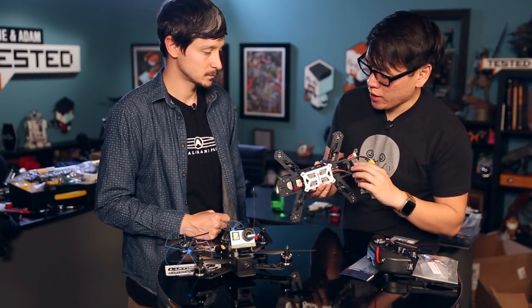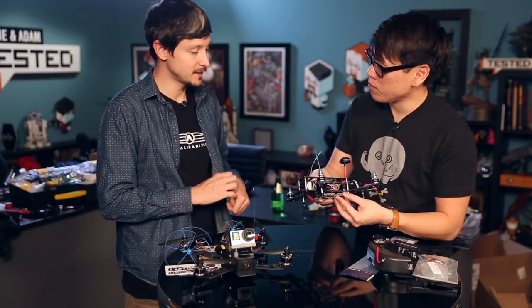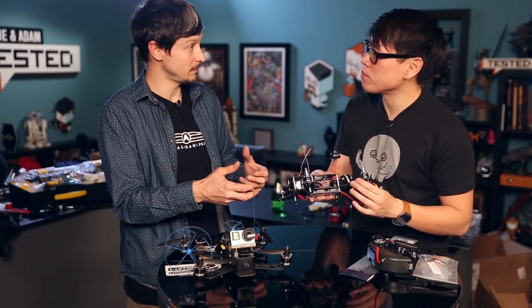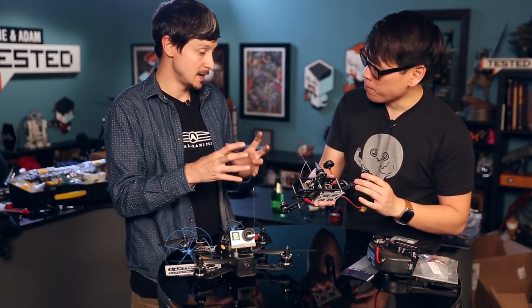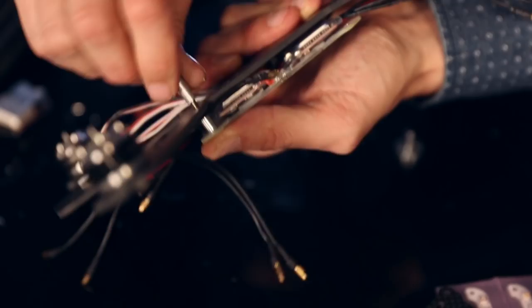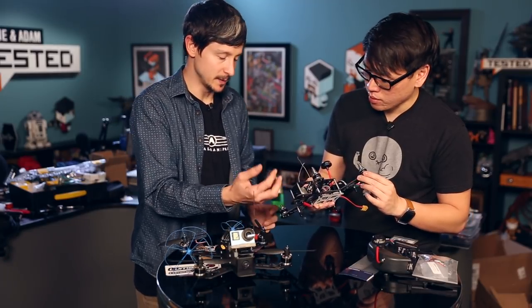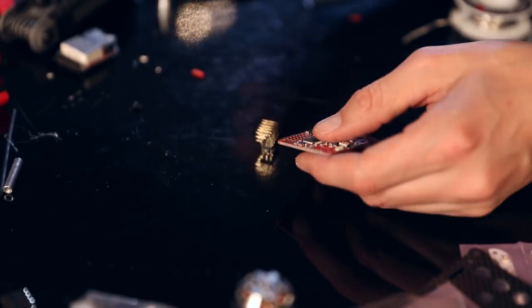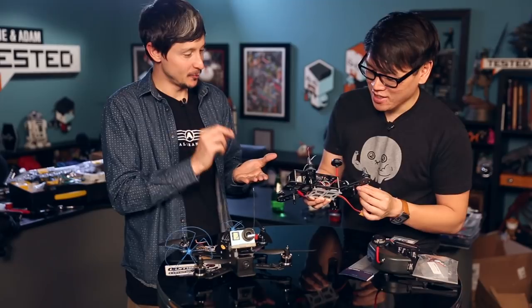When you're looking at a battery to connect, you want to make sure it has enough voltage capacity to power all of this. You've got to figure out the voltages and make sure every part of your electronics is compatible with the voltage you're sending. Otherwise you'll need to add regulators. In this case everything was easy because the FPV gear is already set up and easy to connect. After the power distribution board, we connected it with spacers to the main body of the frame, and then the flight controller. The frame is super easy to build — it almost builds itself. Then we did the NAZE32, which comes without the pins soldered, so we soldered them in.